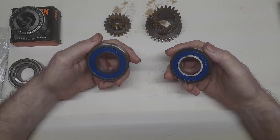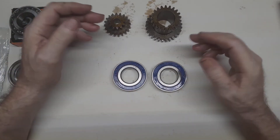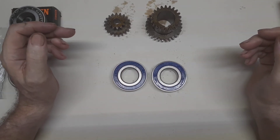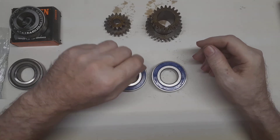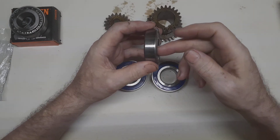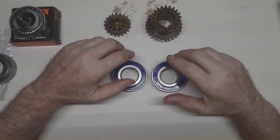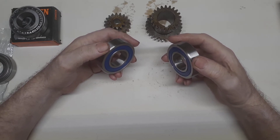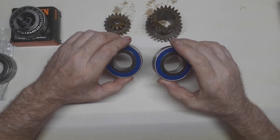These are sealed, and like the tapered roller bearings, they take a preload. The bearings, as a pair, need to take a certain amount of preload — not too much, not too little. This is what makes them much better than the regular ball bearings, which are going to have some give this way and that. These should give a tighter run, meaning more precise cuts on the parts you're working.